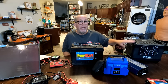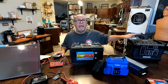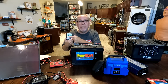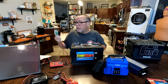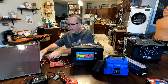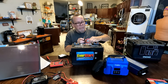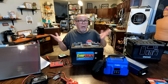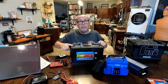If you have a solar generator, it has a built-in charge controller — you can take a regular solar panel, plug the power right in, and it handles things itself. But in this homemade situation we have this panel — let's pretend it's 100 watts. Even with no sunlight on it right now, there's actually some charge: that yellow light shows it. It's enough for a trickle charge. I hook my alligator clips onto the battery terminals — don't touch them together — and now this solar panel is charging this battery. With higher-powered panels you can charge the battery up faster.